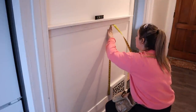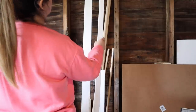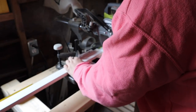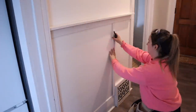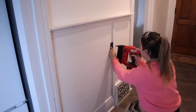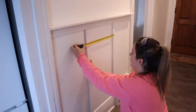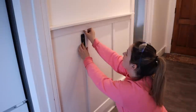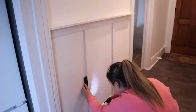Here I am just measuring how long I want our boards to be, and then again I'm going into the garage, taking our one and a half inch primed MDF, cutting that up, and then I can just put it in place. You're going to want to use a level when you put this on — trust me, have a level with you the entire time you're doing this. I'm just using my Milwaukee brad nailer and nailing everything into place. This was the fastest part of it all, and this is where I really got to enjoy it because I got to see it come together. I worked on each part of the wall separately — it was just easier that way.